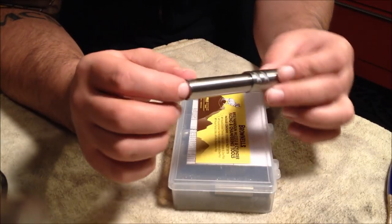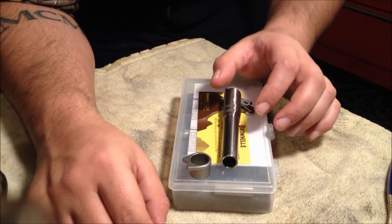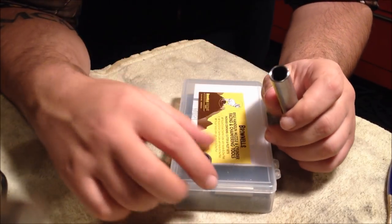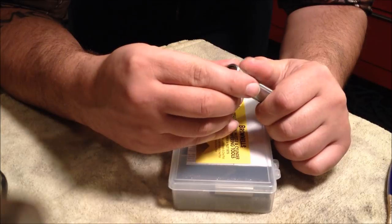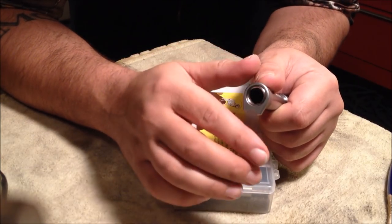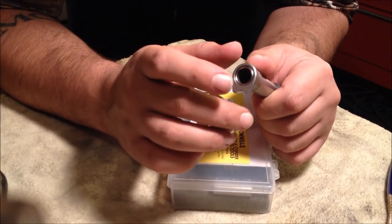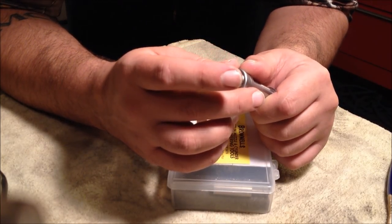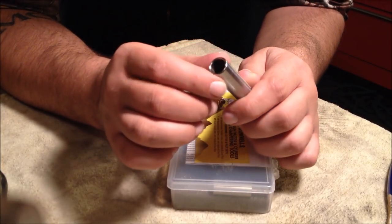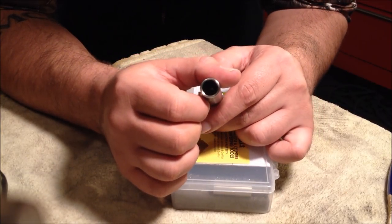But we're here to discuss the 45 degree muzzle crown. The SIG bushing fits flush already, it'll sit like that, but once we dish in the crown there with a 45 degree chamfer tool, it'll look a lot cooler. Mainly the reason we're doing this. I don't think there's any other.